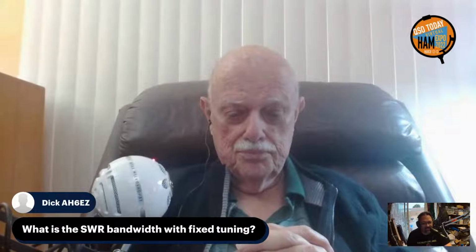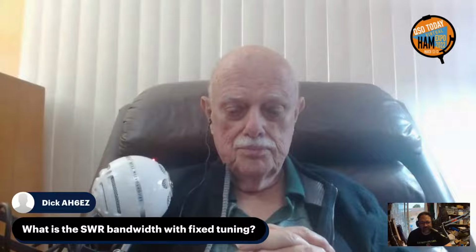AH6EZ asks, what is the SWR bandwidth with fixed tuning? With fixed tuning, what does that mean? I think if at a given tuning of the capacitor, what's the bandwidth? Well, it depends on the loop size. The point being that, assuming you don't go outside and move the capacitor, at any one location of the tuning capacitor, how much bandwidth do you get out of that antenna before you have to move the capacitor again? Of that 4-foot square one? Is that what he wants?